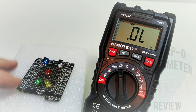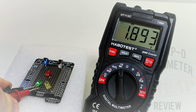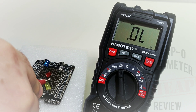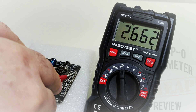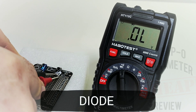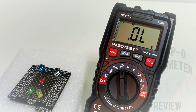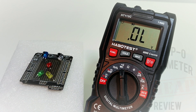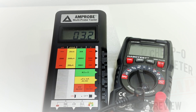LED testing time — can we go five for five? Starting with the green LED: ever so lightly lit with that forward voltage drop. Over to the yellow LED — no problem. The red looks good. Over to the blue — and we are good to go: 2.6 volts voltage drop and it is lit. The 113C gives a solid 3.2 volts maximum output voltage in diode mode.